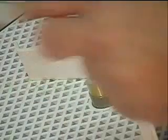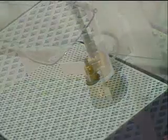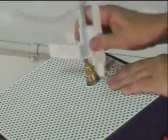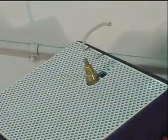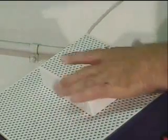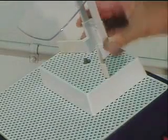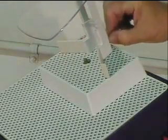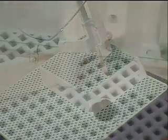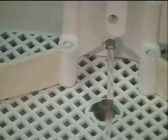We can attach a second smaller bit on top of the regular bit like this, and then add the second story attachment that came with the grinder like this. We'll need to cool this top bit, so we'll run the cooling hose up to the second story also. And there we have it. Lots of water right where we need it.